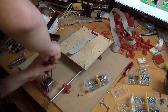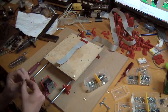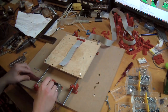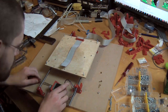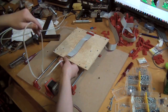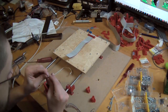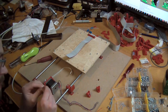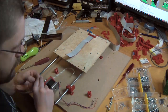This is the first part where I have to backtrack a lot, because I forgot the anchors that hold the belts to the Y carriage. So I have to remove all the smooth rods again, then add the anchors. Then I remember that I forgot to put two nuts in the anchors, so I have to remove them all again. Then I put them on in the wrong way, so I have to do it about three times. This is annoying because they use nylock nuts, and basically every screw in this build either has a star washer or nylock nuts so that vibration won't cause them to get loose over time.